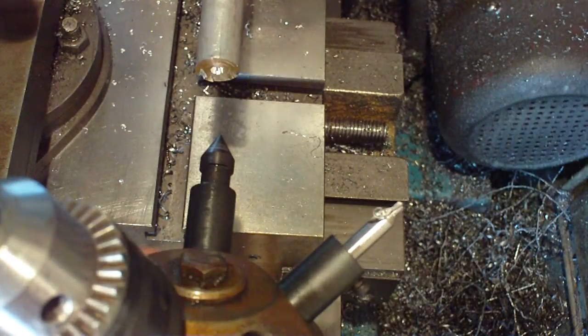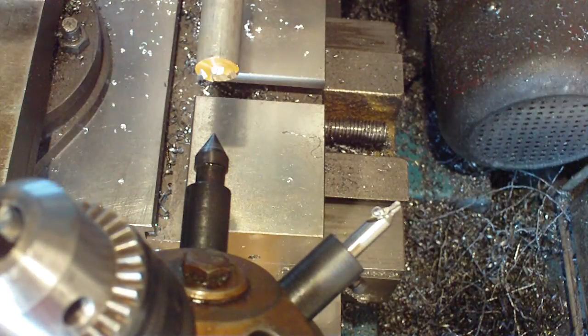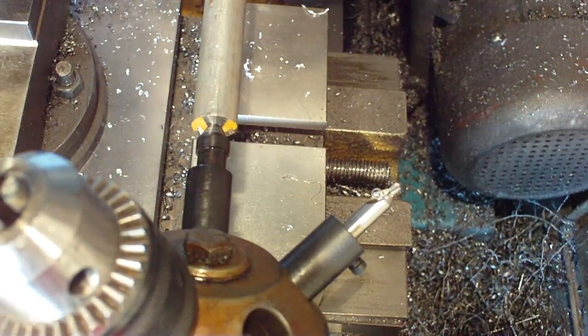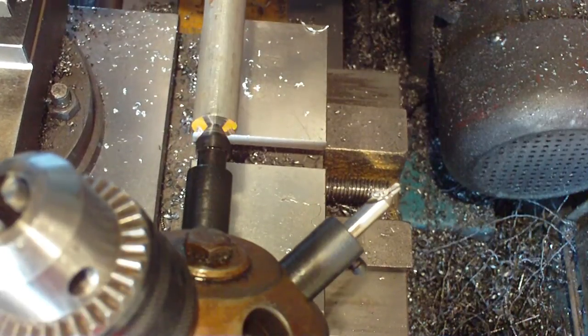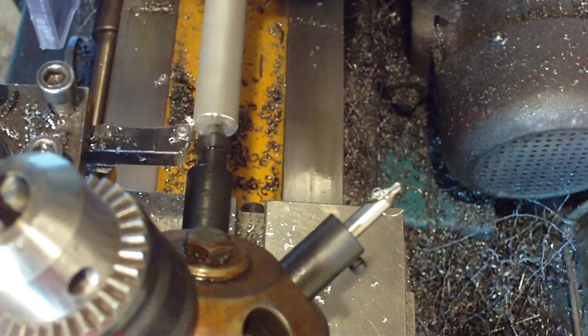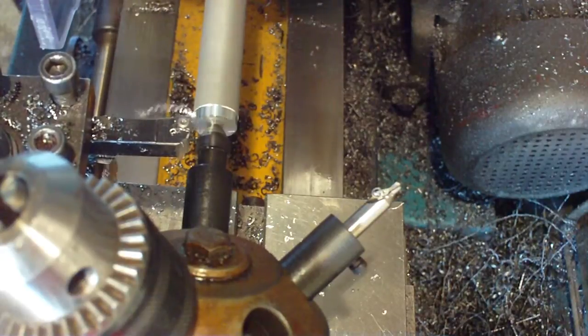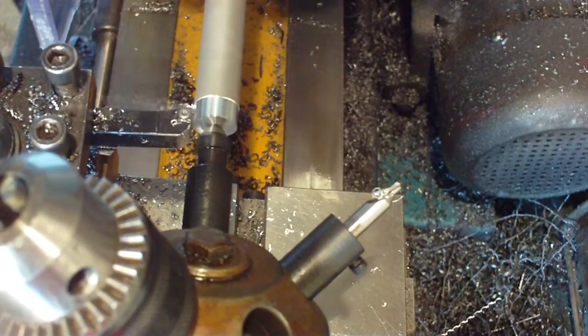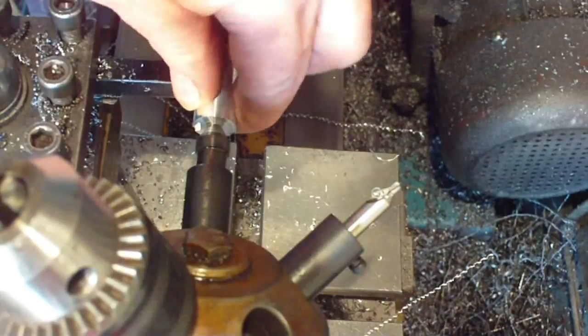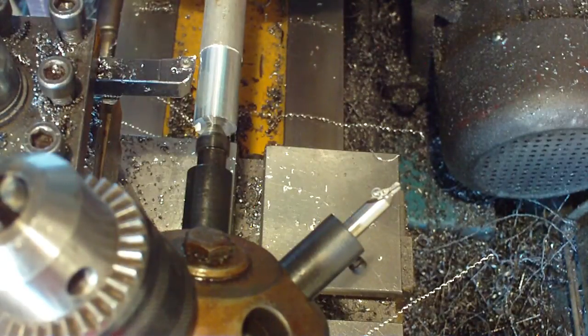Just bring that back a little, bring the metal out. Now what we can do is pull out the stop, turn it round, stop back in, and then put the live center in, crank that up. Now want to bring the tool back - we're now holding it in the little live center. Spin that up, see everything's tickety-boo. All we're going to do is run the tool down for spotty turning. How about that - no play, no nothing.